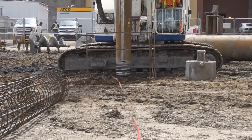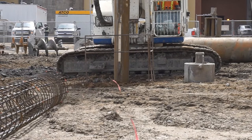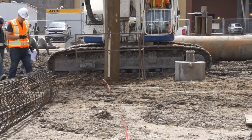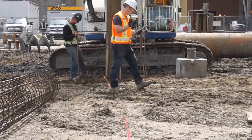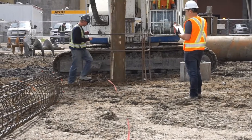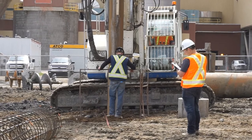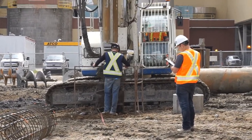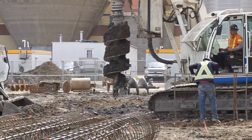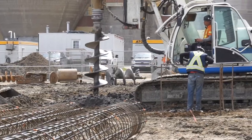This is the drilling rig that's used. These piles are getting drilled around 13 meters, which is right around 40 feet. So he just goes down, drills a little ways, and then he has to pull it up and shake off the dirt — that's how he gets the dirt out. He gives it a little spin and all the dirt flies off, and he goes back for another one.